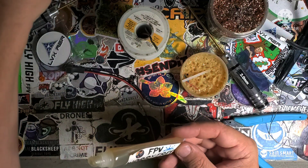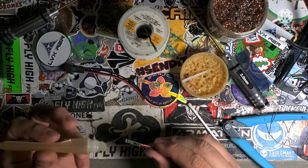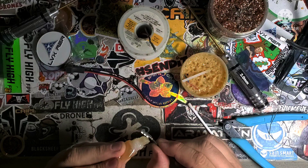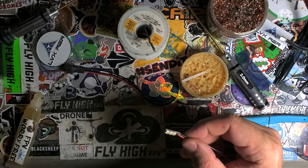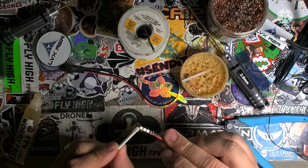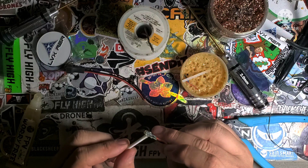These days I'm using Worry-Free — I've started selling it, I've got it in the store now. I've been using MG Chemicals for a long time and I still think it's a great light-duty conformal coating, but I tend to want things heavy-duty conformal coated — something that's going to survive if I put it at the bottom of a creek. In this case, this is going to be inside my controller, so it's not really at risk of getting exposed to water. But for me, the bigger thing is getting it electrically isolated so that if it's bouncing around inside the transmitter and somehow comes loose, it's not going to fry anything — because it's going to be coated in silicone.